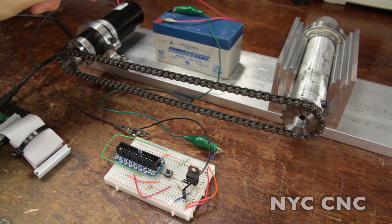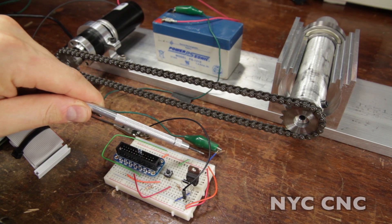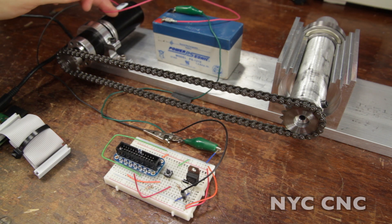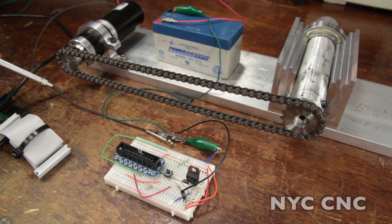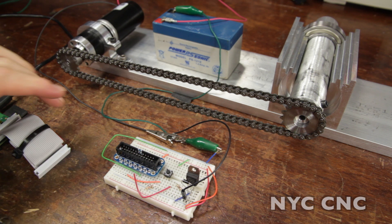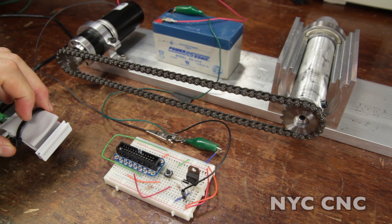To review our connections: the battery's negative terminal is connected via the green jumper wire to the ground rail on the breadboard. The motor's red cable is connected directly to the battery's positive terminal. The motor's black cable is connected directly to the center pin of the transistor. And I'm using the Raspberry Pi cobbler to connect to my Raspberry Pi.